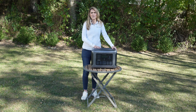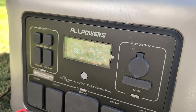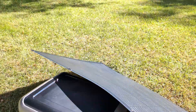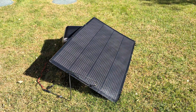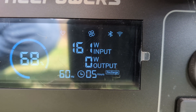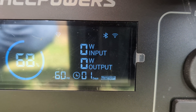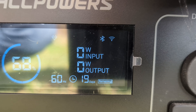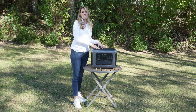I also took this device into full sun with the solar panel plugged in, where it peaked at about 170 watts input and consistently stayed around 160 watts. The device display shows two changing figures: remaining run time and estimated recharge time. If you're net charging, the display shows how long until the battery is fully charged; if you're net discharging, it shows how much time you have left to use the device.